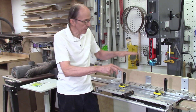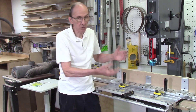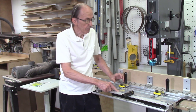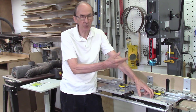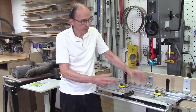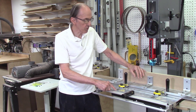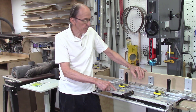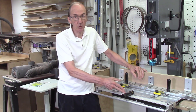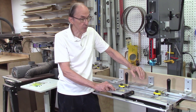The AccuSlice table rides flat on top of the bandsaw table to reduce vibration and give smoother cuts, but it does create some friction. You can see scratches in the aluminum plate underneath your AccuSlice table — any piece of metal or sharp edge on the bandsaw table will cause those scratches, sometimes even a miter bar. So the question is, can we raise this table up somehow and have it ride on some sort of bearings to reduce friction and give smoother cuts?